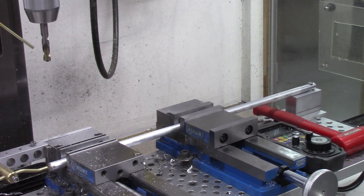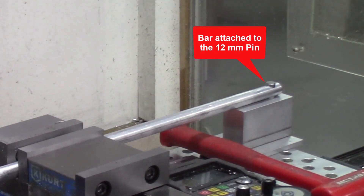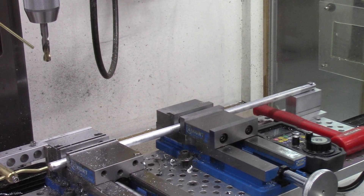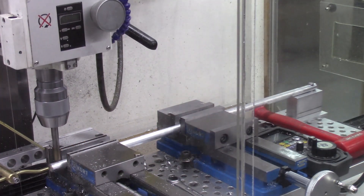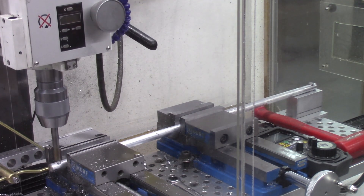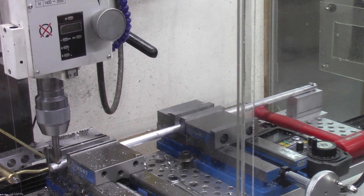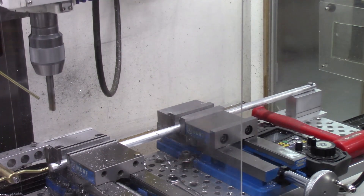For the drilling of the second 12mm hole in the opposite end of the rear support bar, the 5-1/8 inch bar is again placed into the vices on the mill table, and the previously drilled 12mm hole in the bar is inserted into the 12mm pin in the custom drilling jig. The mill has been previously set up so that the space between the two 12mm holes will be exactly 25.5 inches. The 12mm pin not only holds the correct length between the two holes, but also keeps the alignment so that both holes will be perfectly straight and parallel to one another. As a result, I am receiving the same result that I would have received if my mill had a much larger X travel distance. I continue drilling the holes in the remaining 35 rear support bars.